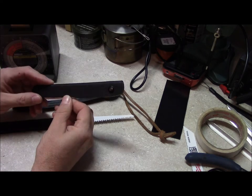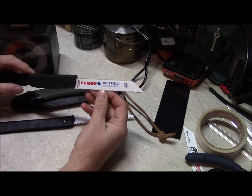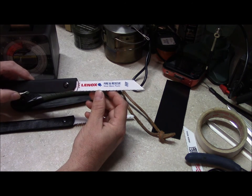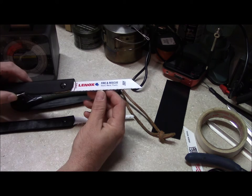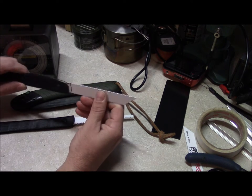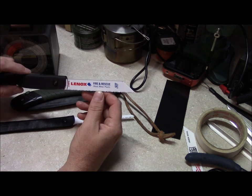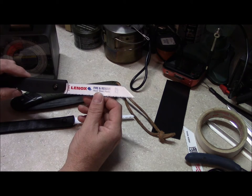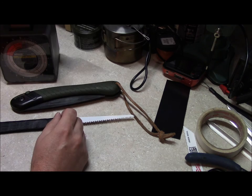Following along that, I made a second one. In this one I used a demolition blade, or an extrication blade. This one is a cross between a wood-cutting blade and a hacksaw blade. It's not a particularly fine-toothed hacksaw blade, but it does cut metal well and it will cut wood very well. Something like this is actually a good option if you want to cover both bases. Weight-wise, this one weighs a tad bit more — it's two ounces.